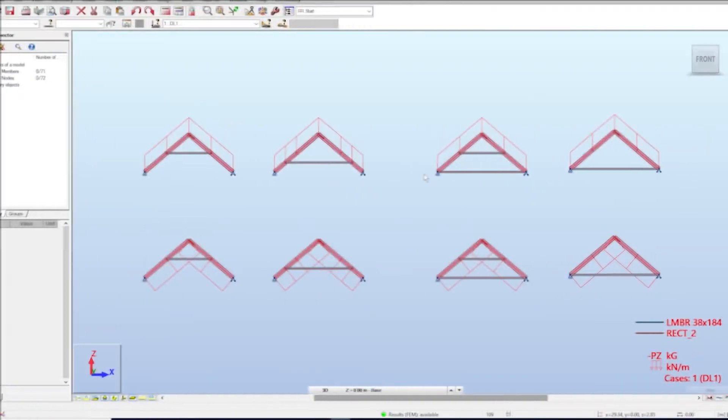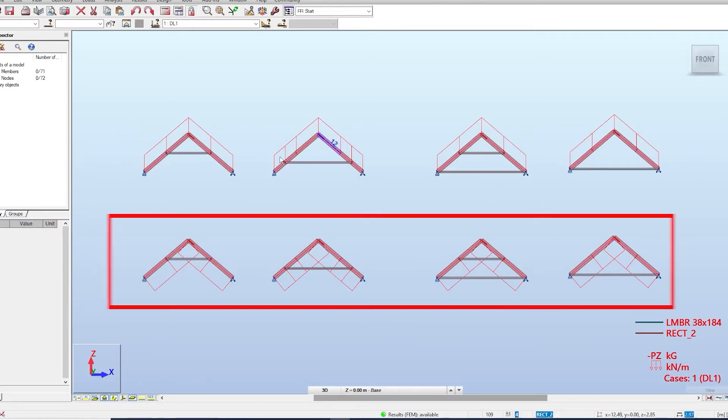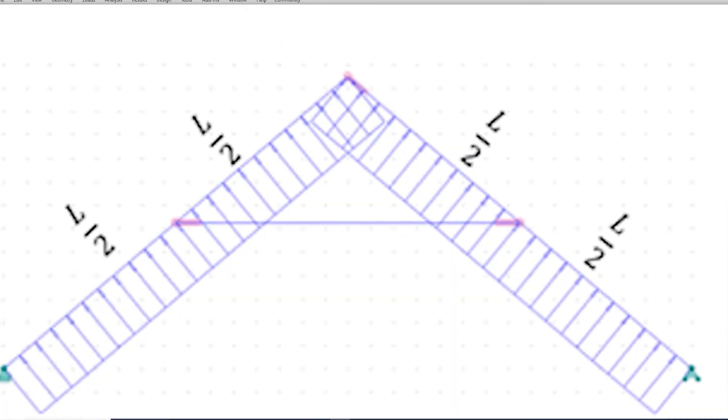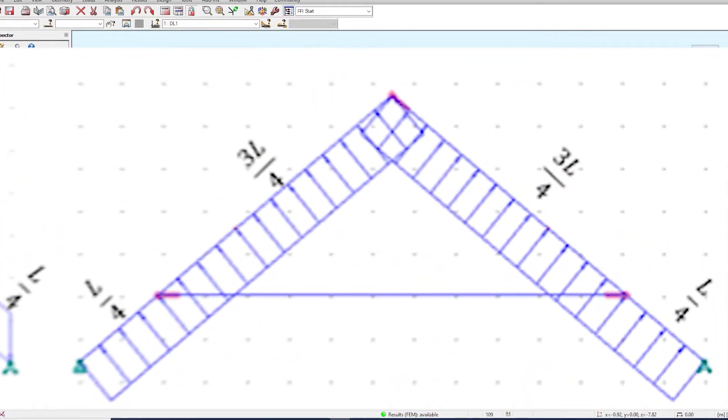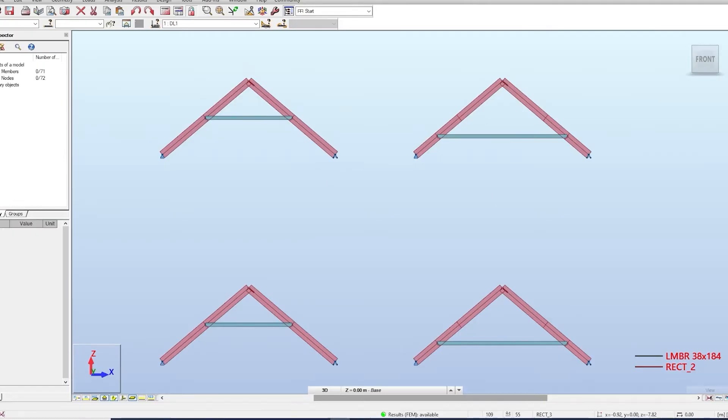This system is more efficient with the two ties present. However, it is common to see only one tie present in architecturally designed roofs. To illustrate the behavior of this structural system, I built four models with ties in different locations so we can see how the roof framing is affected. The models at the top have downward forces and the models at the bottom have upward forces. The first model has only one tie located at the rafter center, and the second one has the tie located within the bottom third of the roof.